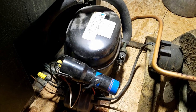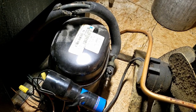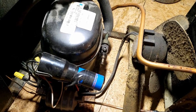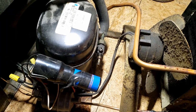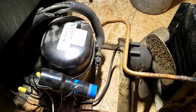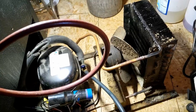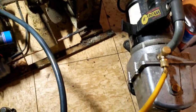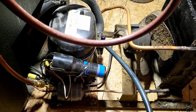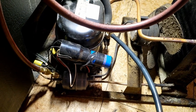This is a little disturbing — as the temperature started to drop, the pressure obviously started to drop too, so we're pretty much out of refrigerant. We're going to hook up the hose with the actual gauge, pull a quick vacuum on this thing, and dump some refrigerant in to see if it even runs. This thing's got issues — it likely has a leak in the evaporator. They probably need to just replace it. We're going easy because I'm not going to waste a bunch of time here. The oil's probably broken down, but we may get lucky.